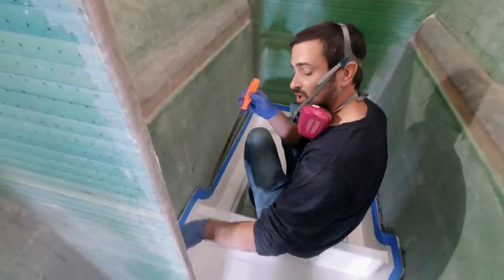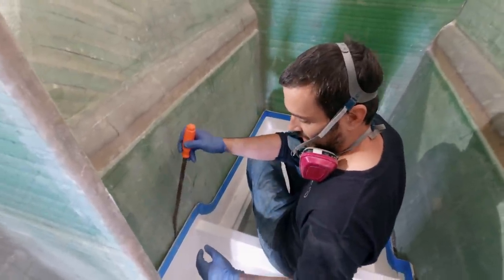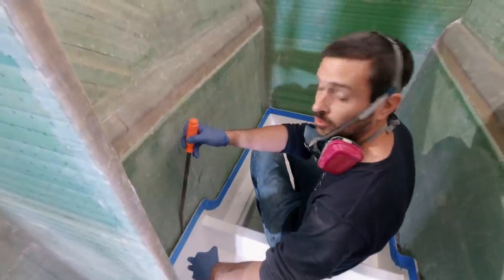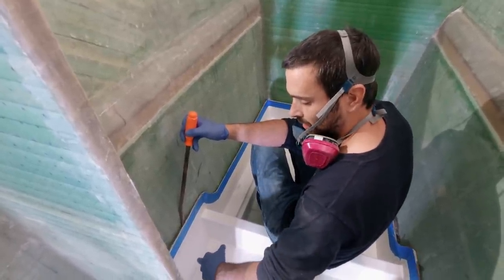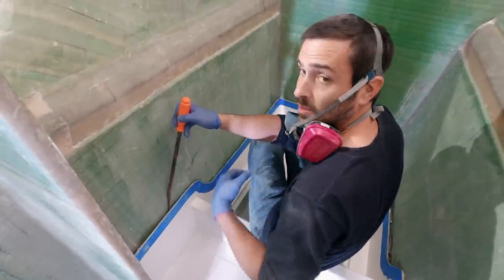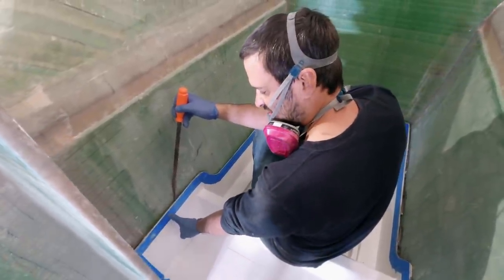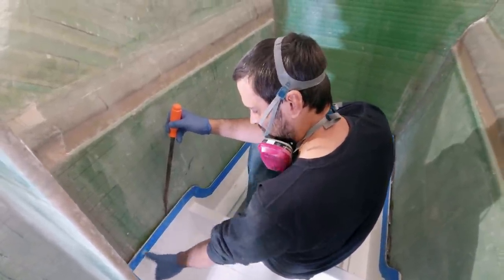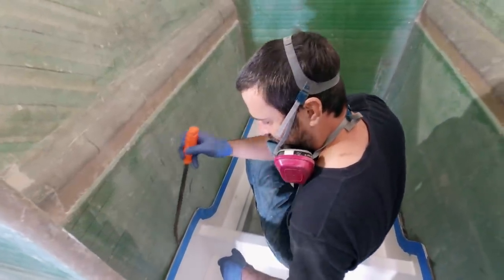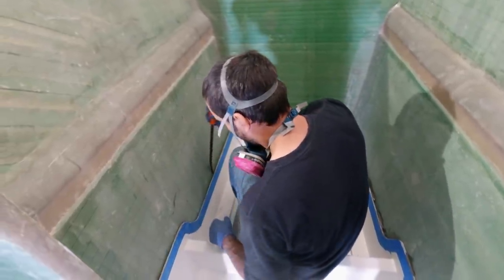So we injected a bunch of the methacrylate across this area, and what I can do is just pull this flange out along here, and you can work it so it goes further and further down. We ended up using enough with the area that we were doing that we should get a good bond along maybe 4 to 5 inches of this area along this side and around here too. So, just working it down a little bit further, and then I will pull this into that edge and squeeze.